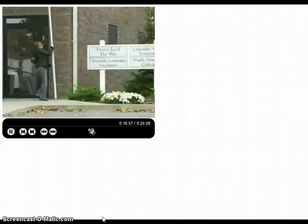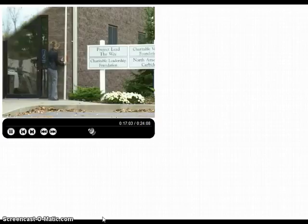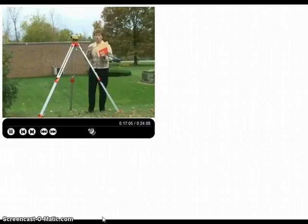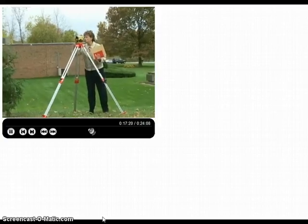Lisa, would you please set up the rod on the point of reference? Use the rod level to keep it straight, please. Notice I've brought my engineering notebook with me. We're going to record the data that I read through my scope from that point that's back there. I'm going to begin by turning the auto level so that the crosshair locations are approximately in line with what Lisa is, and adjust it using this.